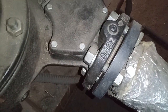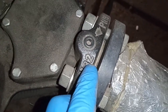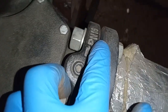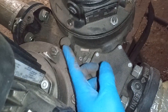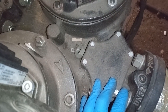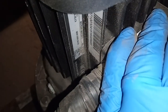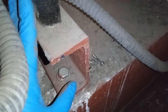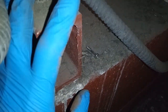Going back to our variable temperature pump — a few things you should know when replacing it. Always record the DN number (diameter nominal). Also note the pressure nominal — here it's PN16. Measuring the distance from flange to flange is important when replacing the body. Check whether it's single phase or three phase. Note that you have pump body details on one badge and motor details on another. Also bear in mind that you may need to build up a support underneath the pump, as they can't just be free-standing.